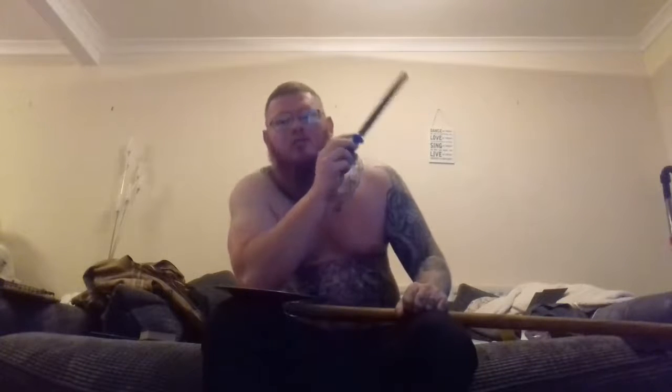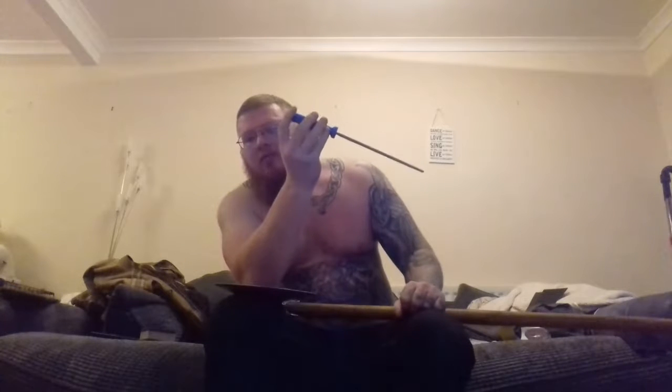What you do with the file is create the edge of the weapon and the angle of the edge, which determines how sharp it is. The steeper the angle, the sharper the blade — but also the more fragile the blade. Going at about 10 degrees is enough to create a point that can cut into things and do quite a bit of damage, but it's not enough to cut your fingers by mistake — so it's not razor sharp. At 30 degrees you've got a razor's edge. You don't have to go any further than that.